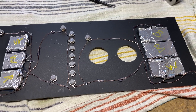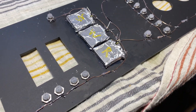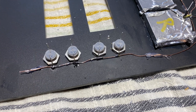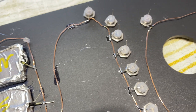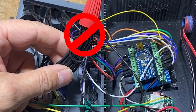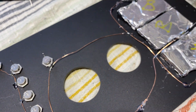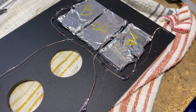I have successfully mounted all my LEDs onto the panel. To minimize clutter and enhance tidiness, I've run a single copper wire around all of them. This allows me to ground the LEDs directly to this copper wire, eliminating the need for numerous ground wires that would otherwise have to be twisted together. It's a sleek solution to keep things orderly. I also have a detailed video on how to do this — the link is in the video description.